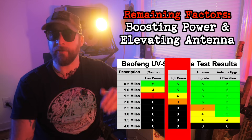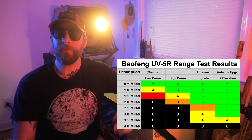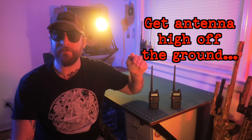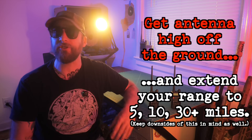Our two other factors — boosting power and raising the antenna — helped too, though they didn't extend the range as much as switching antennas. What those few extra watts and the extra 15 to 20 feet of elevation did was improve the clarity of a message that was already getting through. You have a ceiling for how far you can push power — your handheld maxes out at 5 watts, maybe 8 watts. But elevation is a different story. We only used 20 feet in this test, and that didn't even get us over the canopy of the woods. If you can get your antenna up 50 feet, 200 feet, 2,000 feet, then you can extend your range to 5 miles, 10 miles, potentially 30 miles or more.